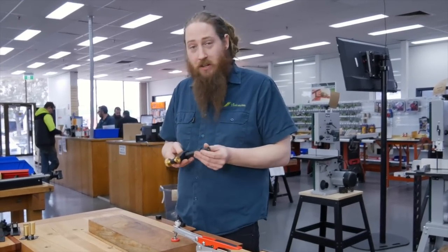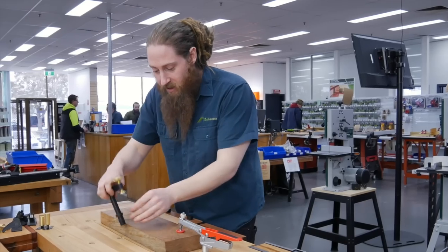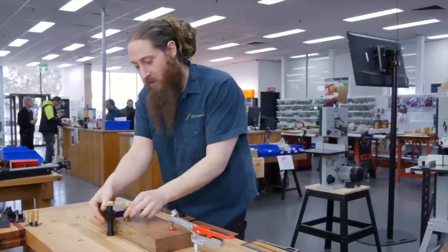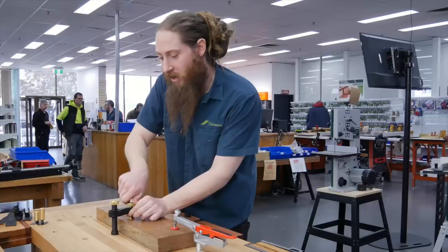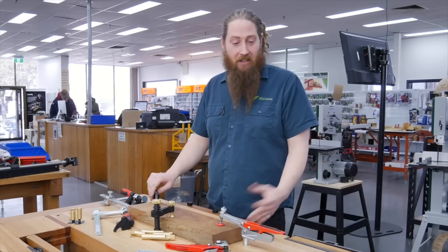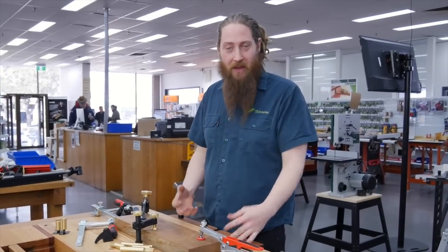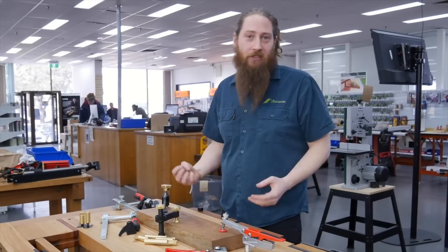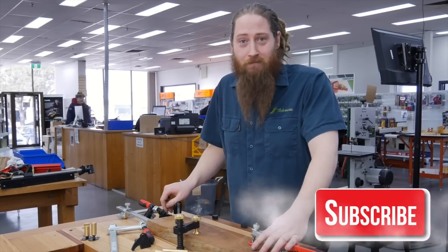The final tool we're going to talk about today is the Veritas surface clamp. How this one works is similar to the way the Bessie horizontal clamps lock in — you've got a split dog here, you slide that split dog into the hole, twist it, and that'll actually separate the sides of the dog to fill that space so there's no movement. Then this part you can quickly move up and down to the right spot and tighten off. So there we have it — a quick introduction to bench hardware. If you're a woodworker and getting yourself a beautiful workbench is something you'd really like to do, have a good think about the parts that will be best use for you. There's a wide range of hardware from cheap inexpensive stuff up to beautifully made heirloom quality tools and everything in between. I hope this has helped answer a few of your questions about bench hardware, but if you have any more questions click on the links below for more information, and don't forget to subscribe.